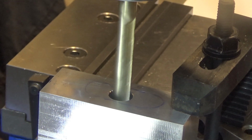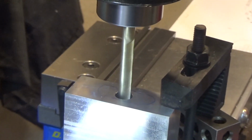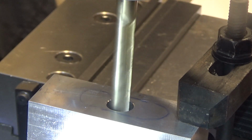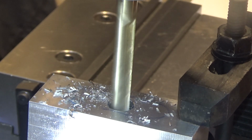So I put a new 0 on the scale over here, so that 0 is 0 since it was convenient. I did remember that this other thing was on 40 degrees, the built-in marker, but now I don't need to worry about it. So what I'm thinking about doing is loosening this guy up. Then traversing my X, I can go 0.187. We'll stop there, and then I can rotate.